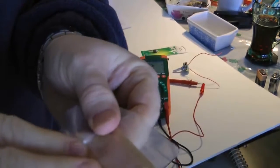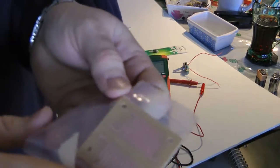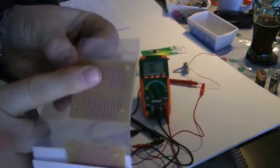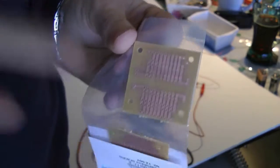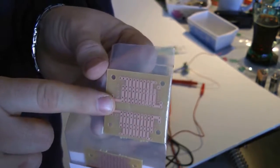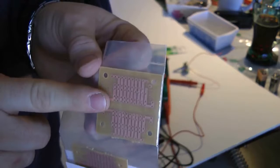And we're going to do a soldering lesson. We're going to use lead-free solder. Most people use lead-free solder, especially if you're new to electronics. It's more difficult to work with, but it's safer. You're not breathing in all those lead vapors, especially if you're young. If you're old like me, who knows whether it makes a difference or not. But I always use lead-free solder, and if you start using it now, you will get used to it, and you'll never have to use lead solder.